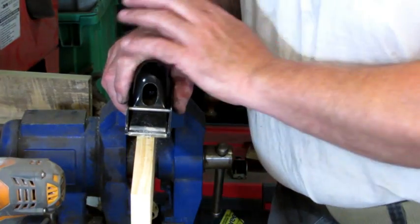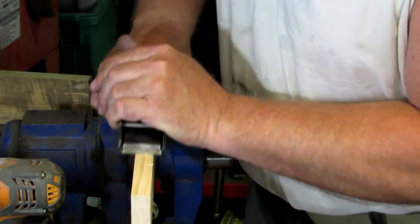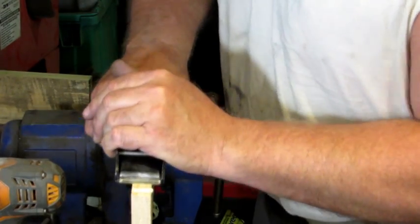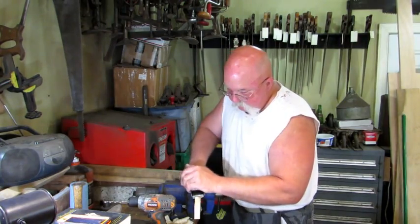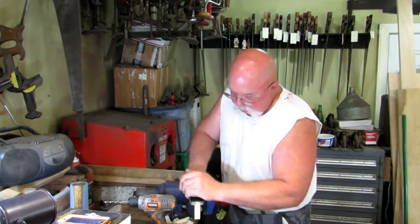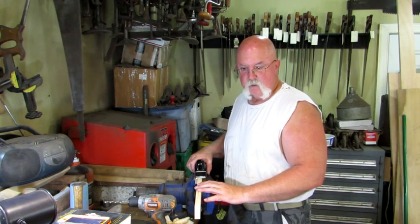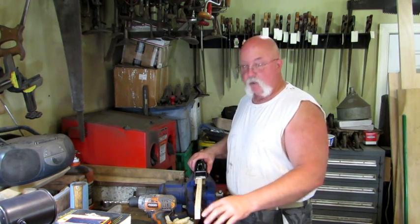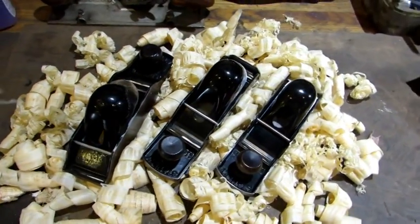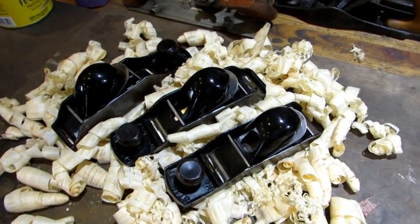On to the last one. It takes a little practice getting the iron set where you want it and how to use it, but as you can see right here it will work — especially if you're trying to get that iron right in close to the edge of something. I can gouge the edges out nice, but that's not the purpose, it's really more fine work. Clearly not as good as — I think it's the number 97 — the chisel planes, the ones that are made for this kind of work. But it is functional. And there they're all done and tested — three really nice Stanley number 130s. I would not modify one to be a chisel plane because they just don't perform as well as the ones designed to do that, but it is functional.